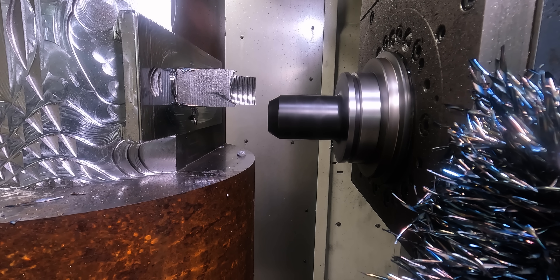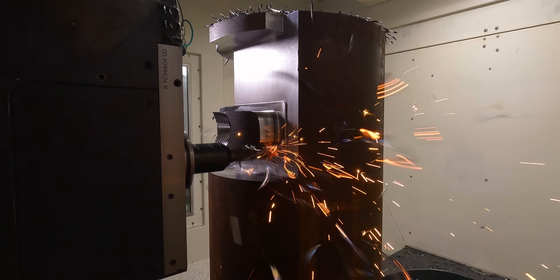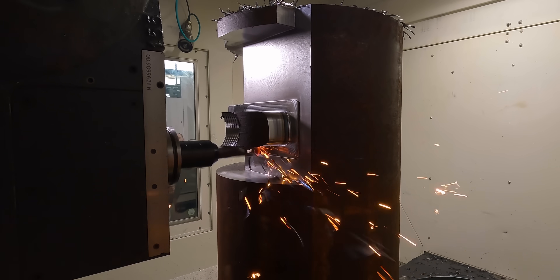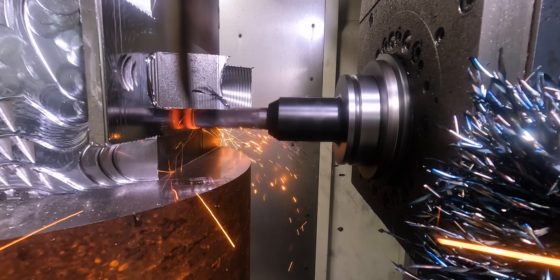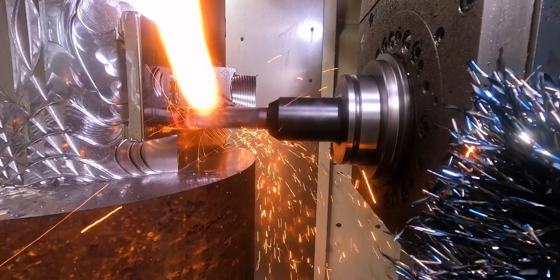There it goes — I saw that one coming. Something else to think about is a lot of people are afraid to break tools. The thing is, if you have to break $3,000 end mills but you're going to save 50 hours, you need to consider your shop rate. If your shop rate is between $100 and $150 an hour and this end mill breaking saves you 50 hours, that means you just saved $6,000 or more minus the cost of the end mills — so we still come out on top if we break a tool. Now, a lot of times when people see sparks they think it's a bad thing, but it's really not, because the heat is leaving with your chip and that's what you want. But in this case, because the set screws in our holder came loose, our end mill got some little chips in it, and you can see that problem is compounding because now the spark is spinning around with the cutter.